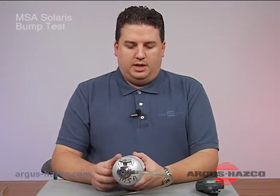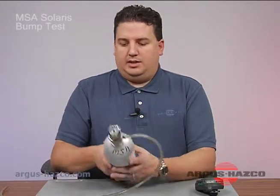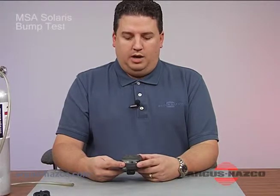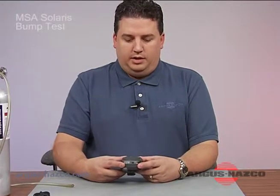The mixture also contains 15% oxygen. You want to ensure that your instrument is set to these values matching your calibration gas cylinder prior to calibration, which you can find in your manual — it explains how to set those calibration values.